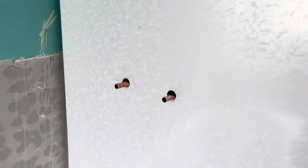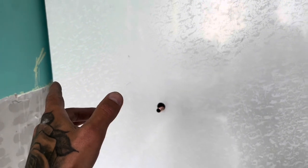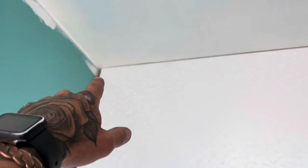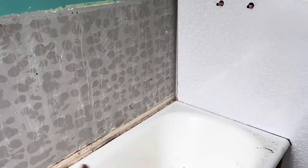Wrestling with this board now. The way you work these is you get your corner panel, cut it down to length, place it in position, then take your measurements from when the board is sat in the corner to what's left. Just need to take a bit out of that top there because it's catching the ceiling. Then go back in and use some stick-like sheet or CT1, any grab adhesive on the back - just loads of little dabs everywhere. Pat it level, then move on to the side ones which will be miles easier because there's no pipes in the way and no awkward L-cut. Once this is on and stuck I'll be able to get that bar mixer and the riser end up.